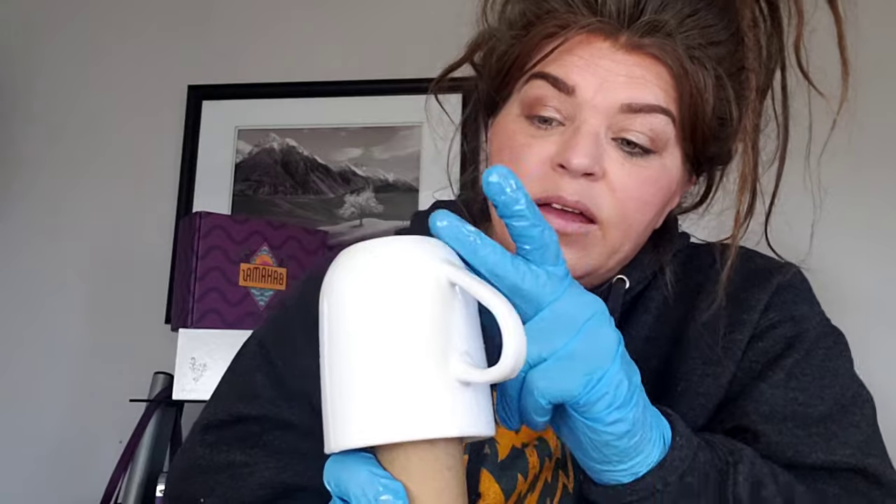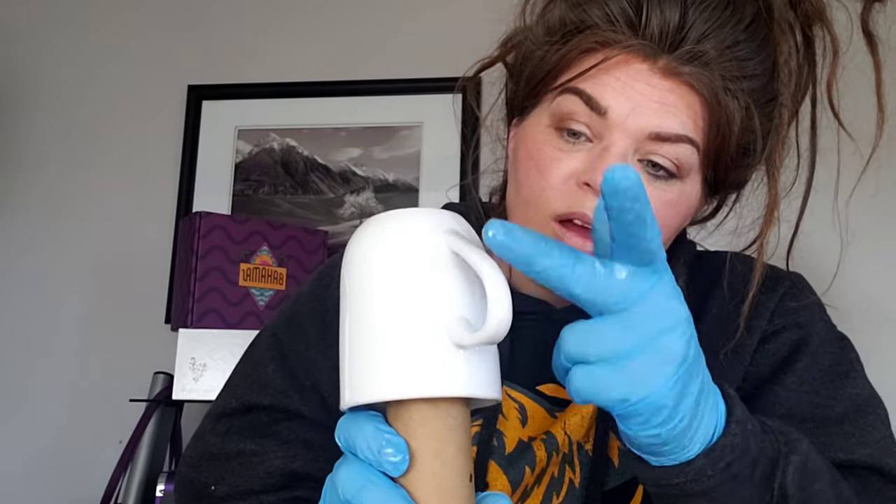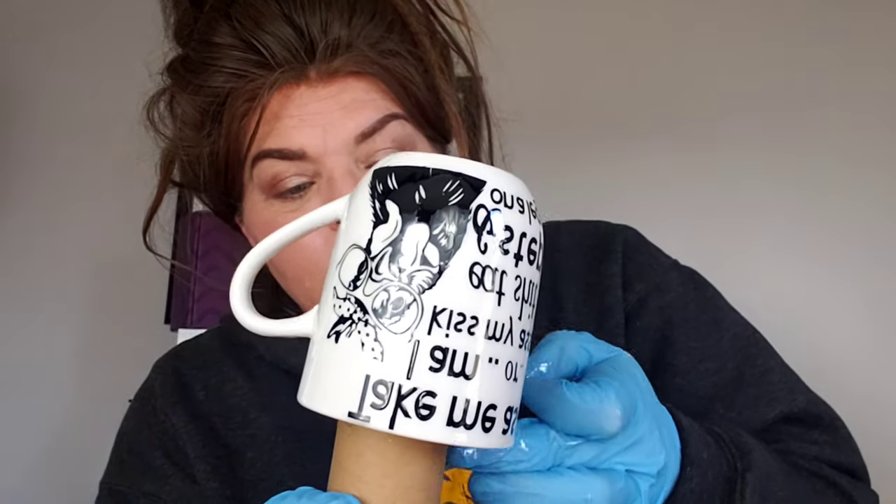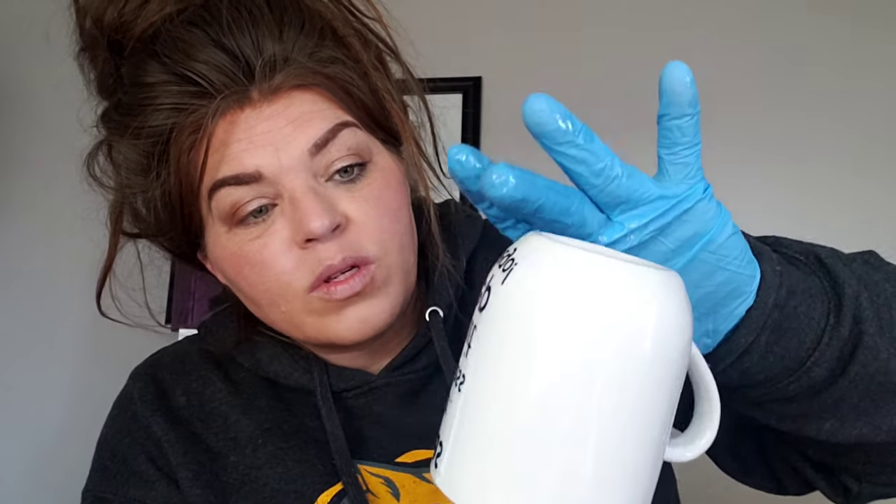But this was different — it was flaking off. I used it on a cornhole set and a couple of cups, and it just flaked off. It turned out it wasn't a two-part mix epoxy, so it wasn't my fault for mixing it — it was a Minwax polyurethane. I don't know if it was expired or if I left it out in the cold or heat, but it definitely didn't set right, so I had to redo the cups and the cornhole set.